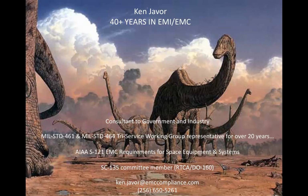The one thing that's unfortunate is we don't have a regulatory lever on this stuff like the cell phone people do. As much as you've got people who want to make cell phones really nice and cute, they still have to allow the antenna people to do what they need to do to get it to work. Aside from the customer being unhappy if their phone drops calls, there are specific requirements that the carriers put on the cell phone manufacturers, and they have to test for things like total isotropic sensitivity and total radiated power. If you don't pass the carrier's requirements, they will not allow your device on their network, and if they won't allow your device on their network, you can't sell it.